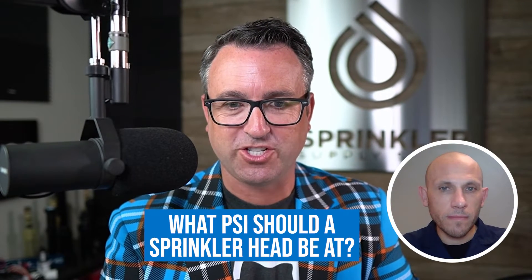So naturally a good lead into question number three: what PSI should a sprinkler head be at? There are three parts to that answer. We'll address the most relevant one first: with a spray head universally. A spray head is short radius irrigation — when you see a spray head come on at your yard, you're going to see the entire pattern instantly, so there's no rotation happening. If it pops up, we're looking at anywhere from two feet out to about 18, in halves, thirds, three quarters, fulls. Universally, every manufacturer through extensive testing has decided that the optimal pressure for a spray nozzle is 30 PSI.